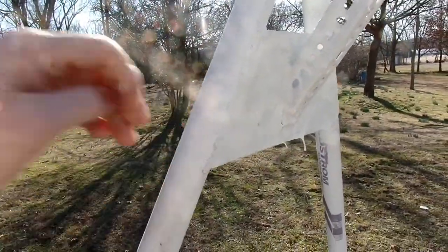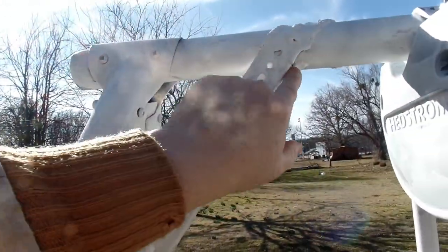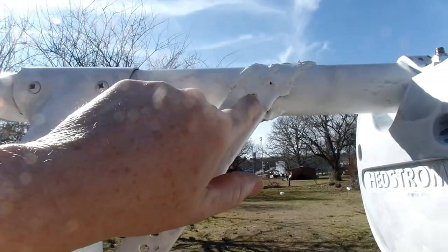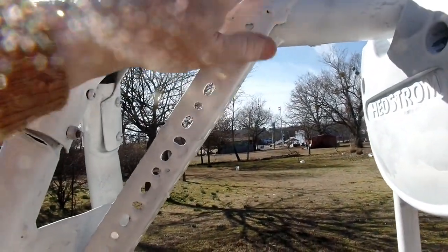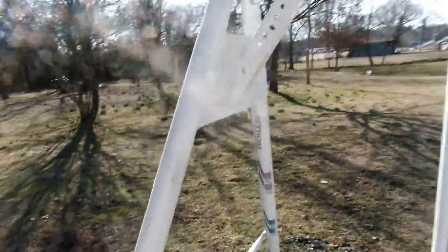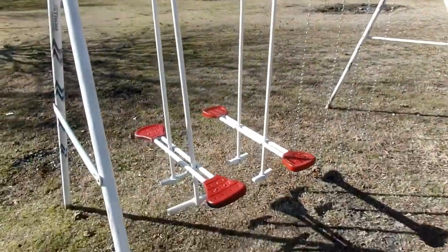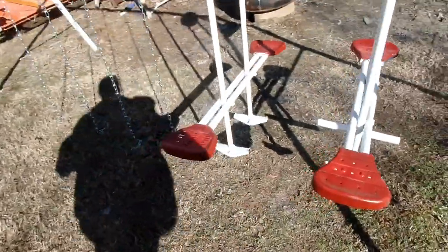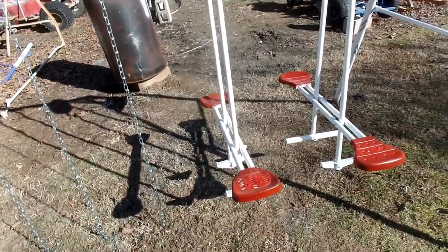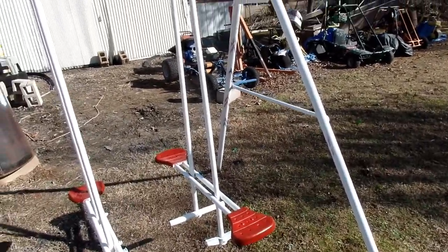Let's go over the brace again — it's 14 to 16 gauge, plain old hanger material. I stopped it right there, cut one piece off, wrapped it around, and welded it everywhere including inside the holes — filling them in is called a rosette weld. I should have great strength on that. You can see I've got some problems here and that's the reason I was doing all this. Two of the hangers and two swings — so far so good. I think she'll last a while.